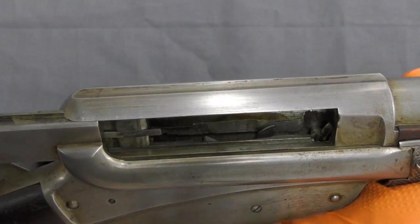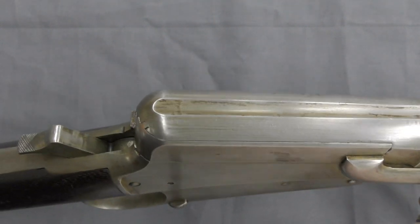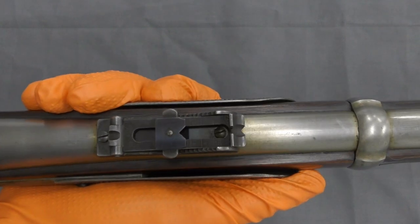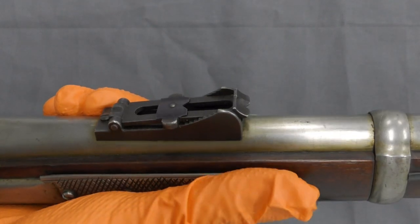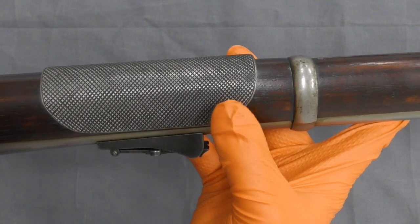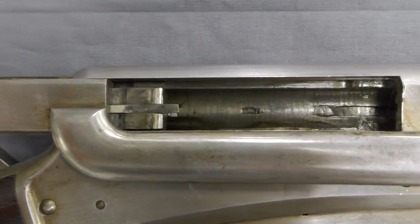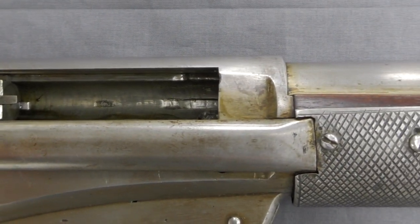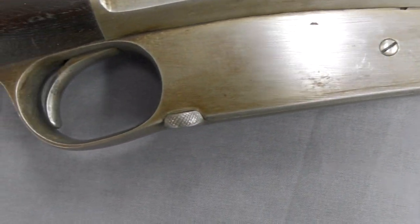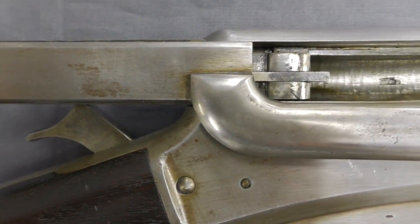The rifle's hammer was cocked by the rearward movement of the breech block. The model is in the white, and while externally the machining and tool work is very neat, internally we can see where cuts in the receiver wall had been made more crudely. In terms of design, the slide action prototype was certainly simpler and had fewer working parts than the Model 1895 lever action. This design never went into production at Winchester, and the rifle we're examining here appears to be either a patent model or a proof of concept. The prototype was previously part of the Winchester firearms collection, which is now part of the Cody Firearms Museum.